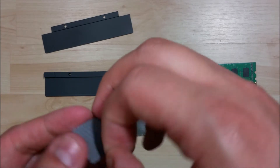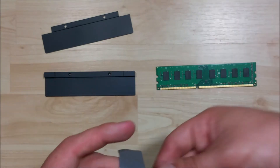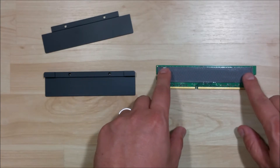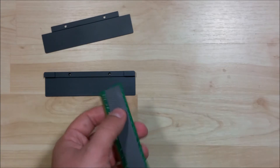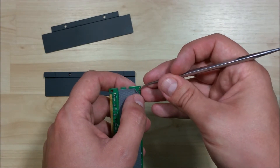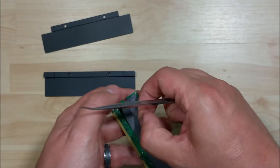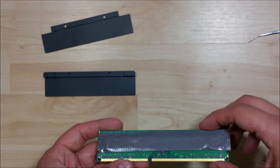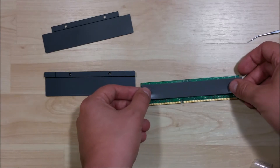We're just going to peel back the backing on top of this thermal tape — it's pretty thin stuff, so the backing can be a little bit tricky. I'm going to go ahead and lay it right on top of the chips and make sure it covers all of them. This stuff is almost like a putty if you've never dealt with it before — it kind of feels a little oily or a little putty-like. When you're removing the backing off of this, it's going to expand itself a little bit. I haven't really found the best way to remove the backing without it gaining a little bit in length besides just doing it slow. You can see it expanded a little bit on the right side — not the end of the world. We'll just peel off just a tiny bit of it and center it back on here.